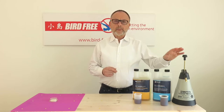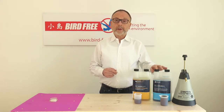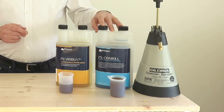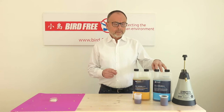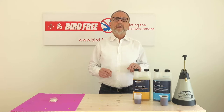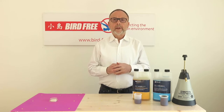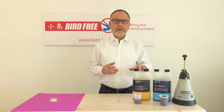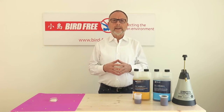Next, we recommend spraying the cleaned surfaces with a light mist of biocide using a pressure spray. For the biocide, we recommend PX Ornakill. The dilution rate for PX Ornakill is 1 to 10 for nests, so you'll need to mix 100 milliliters with every liter of water. Allow the surfaces to dry before applying the dishes of BirdFree. This two-step sanitizing process, using a detergent followed by a biocide, will eliminate the pheromones by which the birds identify their habitat.